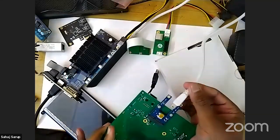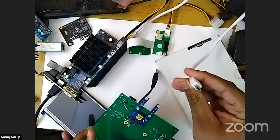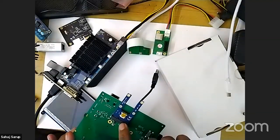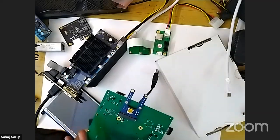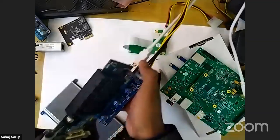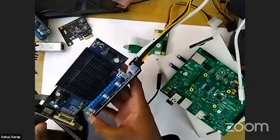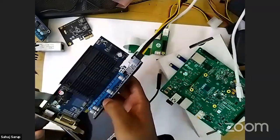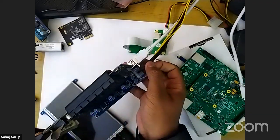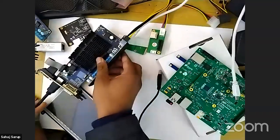And this is a very unique one. It has around twice or thrice the number of USB 2 pins. So those are just enough to get the PCIe x1 lanes from here onto an external card, which is this one. And then that distributes the x1 lanes to the x16 slot. So only the top part of this slot is populated with PCIe. And then you can plug your graphics card on there. It has external power from the power supply, so your graphics card doesn't really draw any power from the Oxalis.